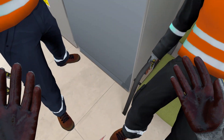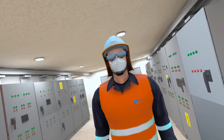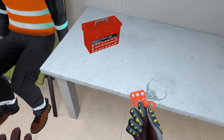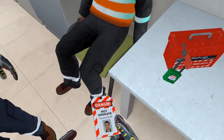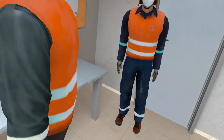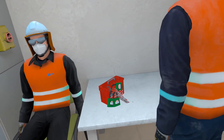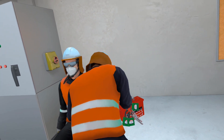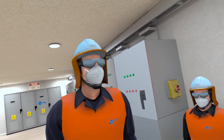Now I place the key in the lockbox. Okay, now place the clamp in the lockbox along with its padlock, and then everyone else put your padlocks. Go ahead. Now your three padlocks are well placed. The belt is completely de-energized and locked — this way you can safely work on it.